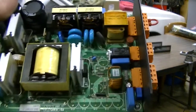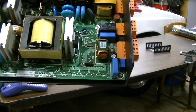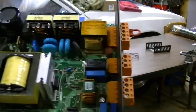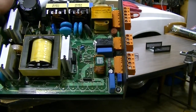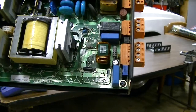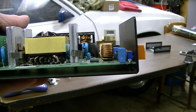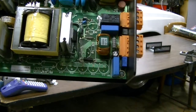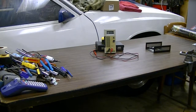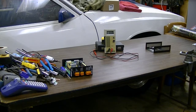What I found was most of the electrolytic capacitors on the output were pretty much gone. You can see here — one, two, three, four, five, six, seven of them all in parallel. Basically they all had the tops popped up on them, like happens to blown electrolytes a lot of times. The capacitance on each individual one was way off. One thing I don't have yet is an ESR meter to test ESR. It was obvious that those capacitors were just plain junk.